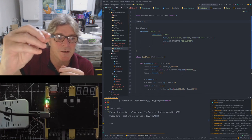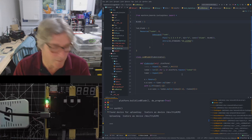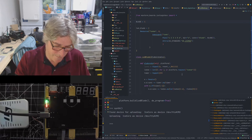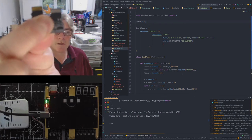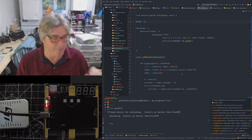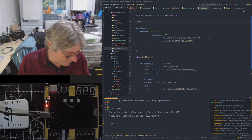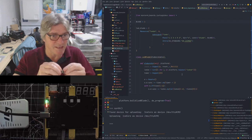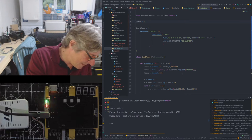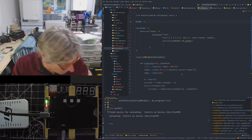But there is a little bit of side movement as well, so maybe we've got a bit of expansion. But of course, the other thing is, if you compare the length, we're going a lot further out. That gives us a lot more leverage, so any small movement inside the SD card is represented by a much larger movement on the outside. So there's definitely some fiddling that needs doing with the dimensions to get these to be more consistent.